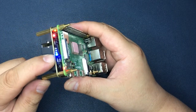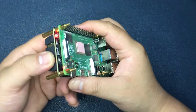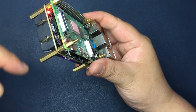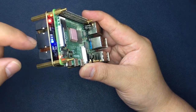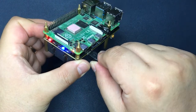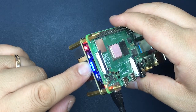You will see the Raspberry Pi light has turned on because I have already enabled the back-to-AC function. There is only one LED blinking even though the battery is fully charged — don't worry about that, because at the very beginning the MCU will be sampling. After sampling, it will show you the correct battery status.